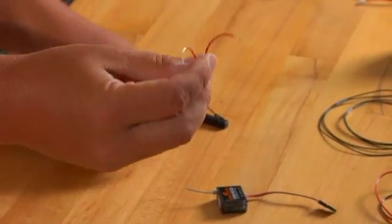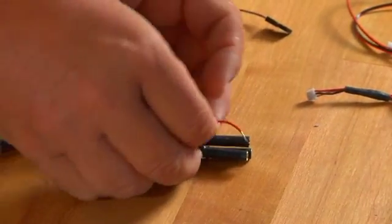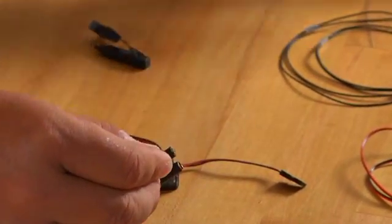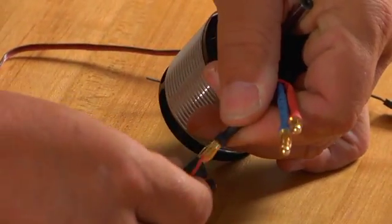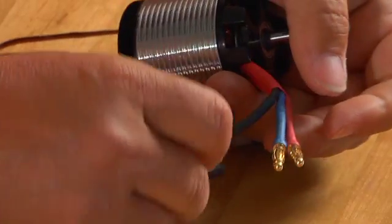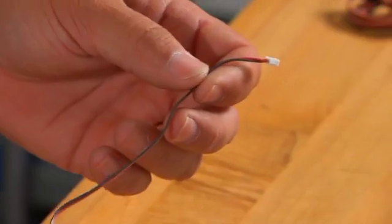The brushless sensor has two red wires, and I've already stripped the ends. If you're going to do this permanently, you're going to solder this. I have a speed controller here — I would solder this to two of the motor leads, and then cover it with heat shrink tubing. But it's also acceptable to just bend this over the end and then install the bullet connector. I would also put a piece of heat shrink tubing over this to hold it in place. It's very easy, and then the other end with the lead plugs into your module and you're ready to go.